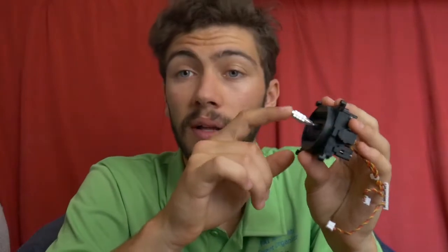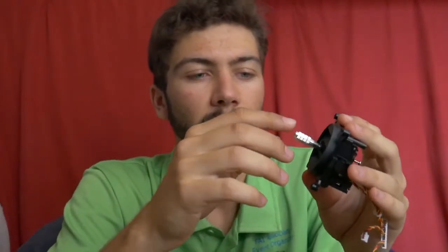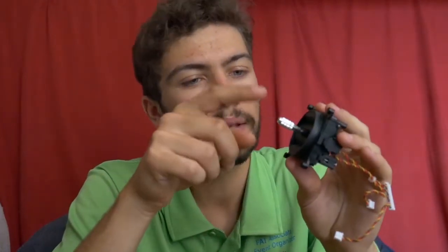We'll talk a bit about why I use Hall effect gimbals instead of standard gimbals. This is what was originally in my Taranis — and it's the only thing that can regularly fail. Standard gimbals use sensors like a fork that scratches a piece of conductive carbon, and depending on where the fork is, it signals position by the current in the carbon plate.